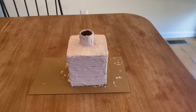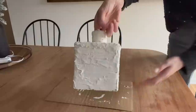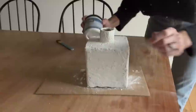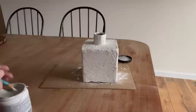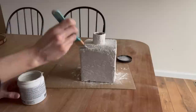If you've used this before you know that it goes on pink and you'll know it's dry when it turns white. When I saw it in the morning I was so excited because it was very sturdy and the texture already looked so pretty. I wanted to show you a close-up of how the texture turned out before painting. I grabbed a medium sand block and sanded off any super rough areas — spackle can be a little dusty, so making sure you don't have any loose pieces will help everything stay intact. Now I'm going in with a base paint I had left over from a different project. I ended up not needing to do this step, but I wanted to show you the process and why I was very tempted to leave it this color — I thought it was really pretty and could have been left alone.